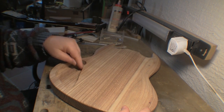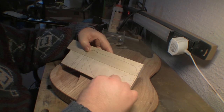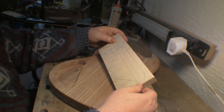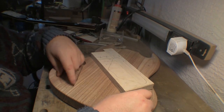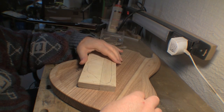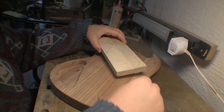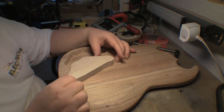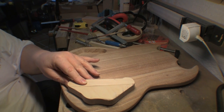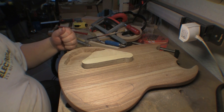So that's a 20mm-deep cavity. Here's some very strong, heavy birch plywood which is 20mm thick, and I've copied the outline of this cavity onto it — actually just two scrap bits of the plywood joined together. I'll cut that out, glue it in here, and make sure there's no air gaps. Put loads of glue, let it dry, sand it all flat, and we can go on. When I cut this piece out I'll use it to mark out the outline of the other cavity on the other side.